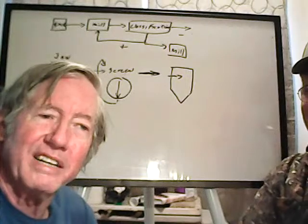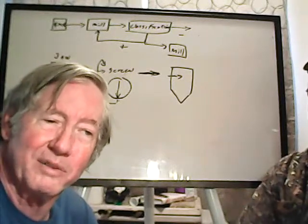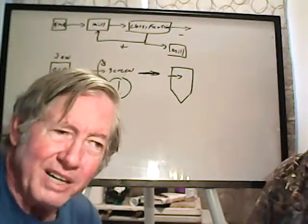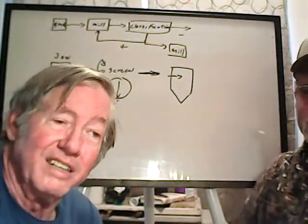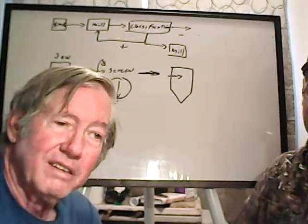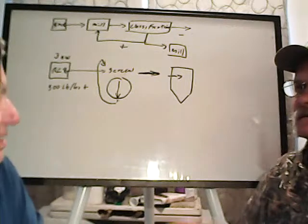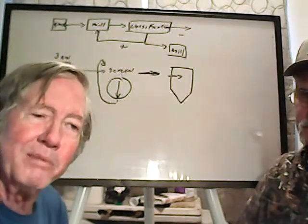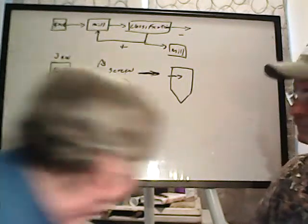But if you were to get 100% recovery out of the stage 2, you're looking at 0.6 grams for a 10-gram charge. So you're going to want to put in like 1.5 grams of silver, roughly. And if you don't get the recovery, you're just going to wind up turning it into dust and having to filter it out. We're trying to go with like a 2-to-1 silver to gold ratio, so you can dissolve it and it's still a chunk. But you anticipate at max about 0.6 grams of gold for 10 grams of that material.